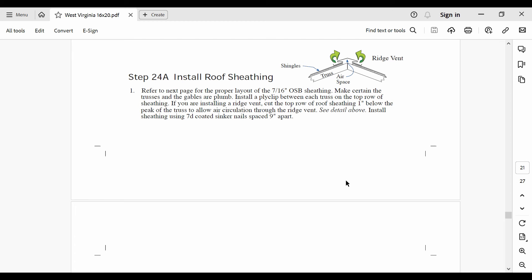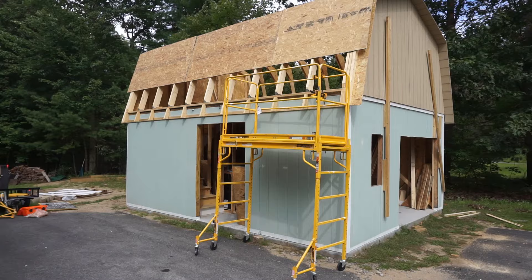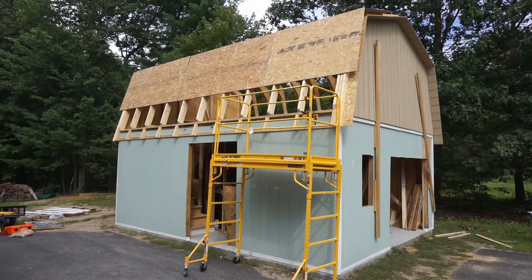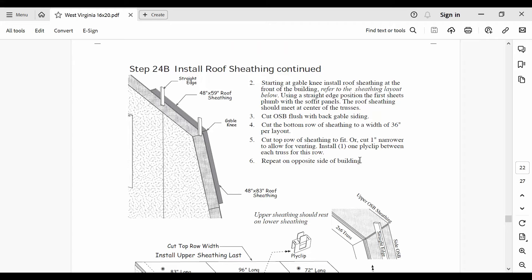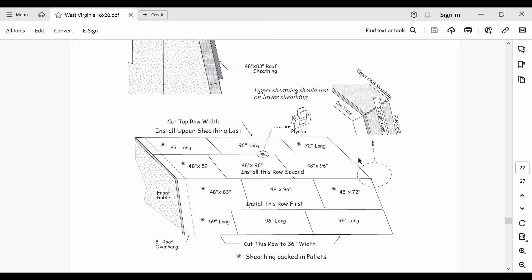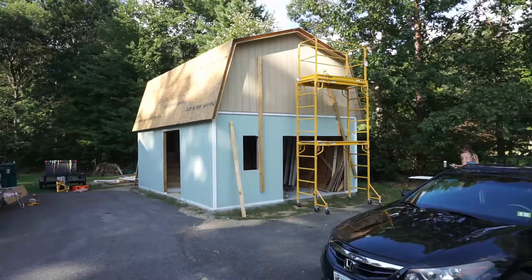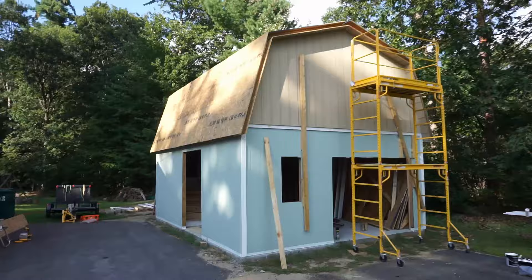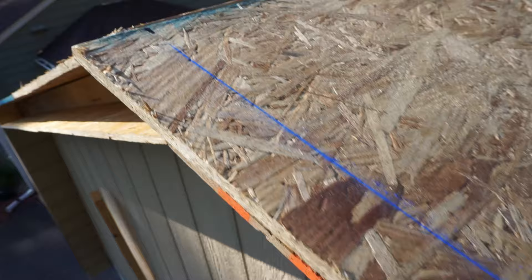The next step was to install the roof sheathing. The sheathing panels have to be plumbed with the soffit panels and the sheathing rows have to be installed in the order shown. Scaffolding was absolutely necessary for this step, so I rented a set from Home Depot — I used indoor rated scaffolding, covered it with large tarps when it rained, and made sure there were wooden boards underneath the wheels when using it off pavement. The bottom rows of sheathing reinforced those soffit blocks from step 19. To add screws for the last top layer of sheathing I had to climb up on top of the roof — not fun, but at least the sheathing was rough enough to give me secure footing. Unfortunately one board ended up not being plumbed with the soffit, so I had to do some trimming with a chalk line.